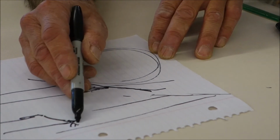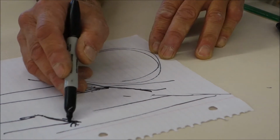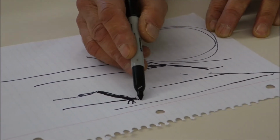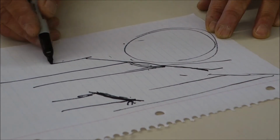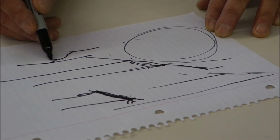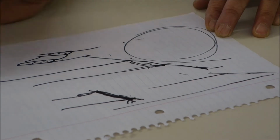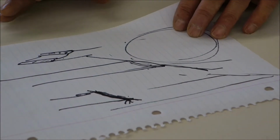And as you sharpen several times, eventually this hollow grind reduces and reduces until it's flat. Then that's when it goes back on the grinding wheel, and you hollow grind it again, and you're just honing the edges. So the blade, to exaggerate, in the end looks like this, and these would be shiny here. And we're not doing a hollow grind. I'm just telling you that as background. We're doing a flat grind.